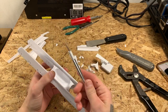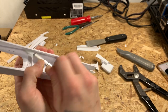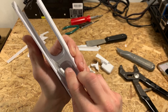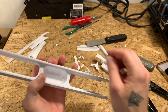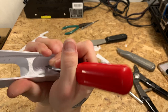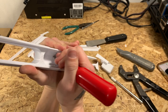Now I'm going to come in here with an X-Acto knife and get rid of all this extra bit of support that's still in there — just shave it down flat to where the body should be. Because you want that core to sit completely flat. You don't want anything in the way. If it's just a tiny little piece it will probably compress, but I'd rather make sure it's completely clear and clean. I'm going to take this flathead screwdriver and break off the rest of the support still sticking into the inside of the grind block area, basically scraping it flat. You don't want that stuff breaking off and rattling around in the frame later.